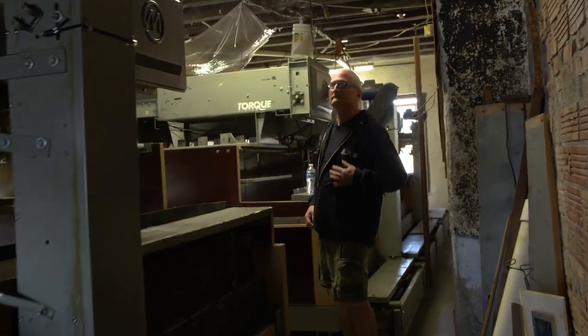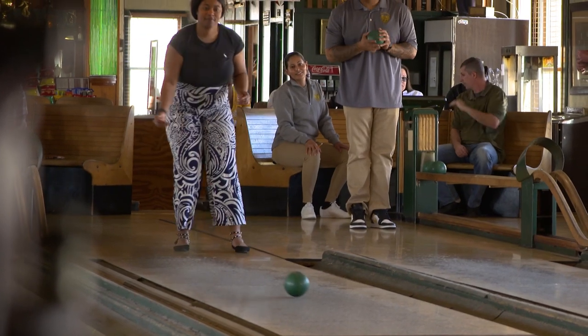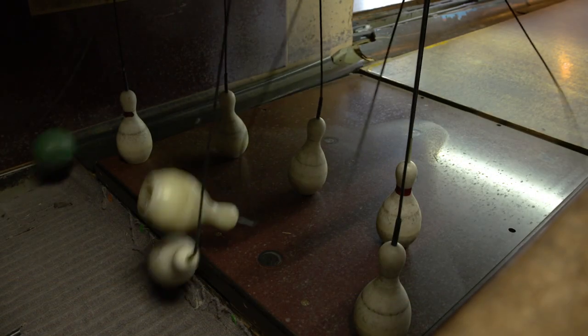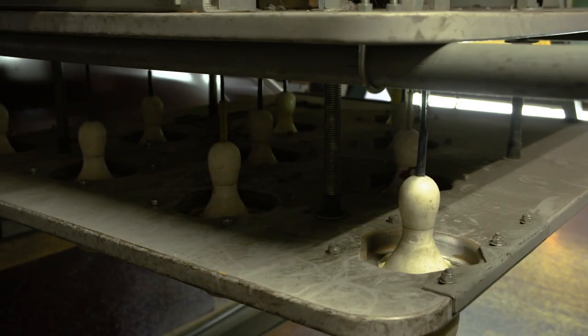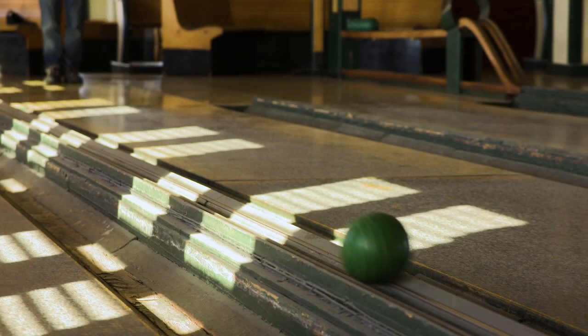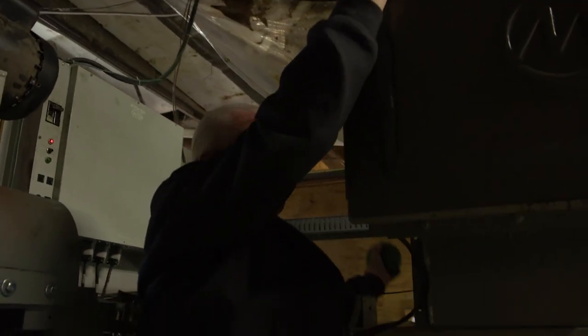Behind the scenes, Stewart keeps the ball return and pin reset system up and running. You roll the ball down the lane, and just before you get to the masking unit, there's a sensor down there. It sees the ball and sends a signal up. Whatever pin has been knocked down, that sensor knows to pull those pins back up and set the other pins back down. Then you have the ball return — it's just a chute with chains and a lift, and it sends it right up and rolls right back down to you. Maintenance on these, as far as pins, isn't too bad. The more maintenance is in the computers that run the things.